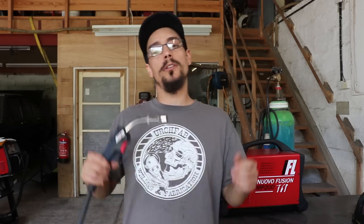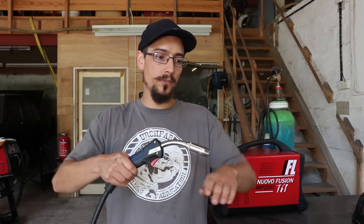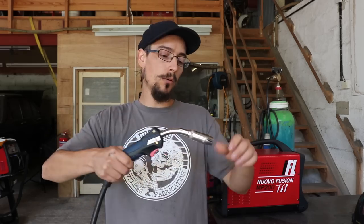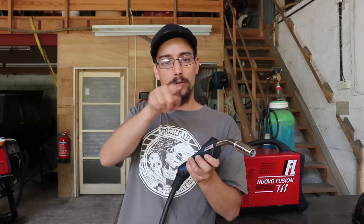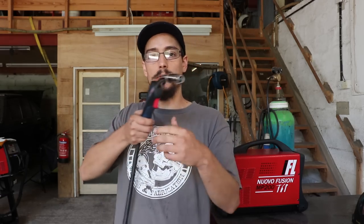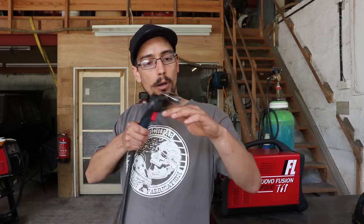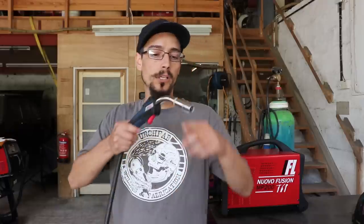And then when it comes to putting a ripple in it, there's loads of different ways of creating that rippled look to a weld. You sort of roll the torch around as if you were drawing a spring, or doing a load of E's connected up. That's the way I probably use most. You're rolling the weld back on itself, and that'll give you that rippled look.